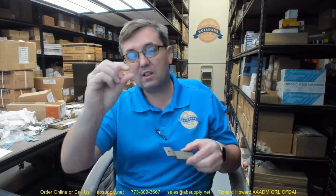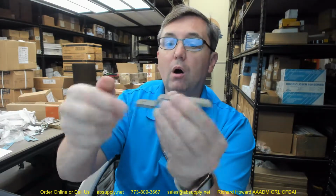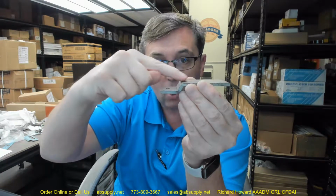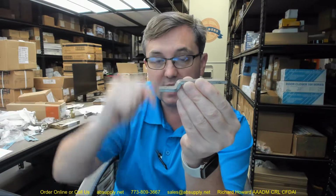So the only real unknown, and that's why that dimension is going to be shy on their eye dimension, which is 15/32, is because you need to account for the thickness of the material, and perhaps my original dimension was more accurate. Let's say that you had 16 gauge on your frame. Well, if you install your hinge, and this dimension was about 0.407, and your hinge leaf thickness was 0.46875, well, you add another 60 thousandths to that, and you're spot on, because your hinge is going to come up. It's going to stand taller than this, because the thickness of your material is going to take up the difference. So whether you're dealing with 16 gauge, 14 gauge, or 12 gauge even, this is really going to be intended for about a 16 gauge frame.